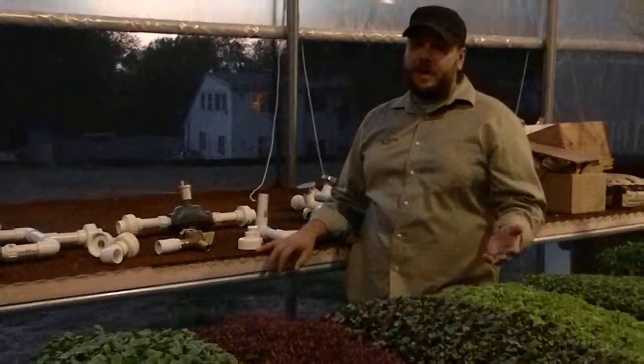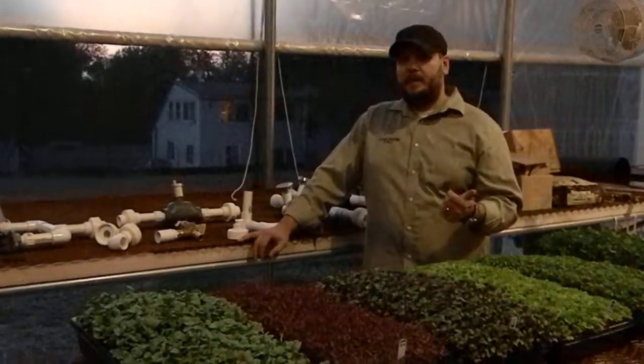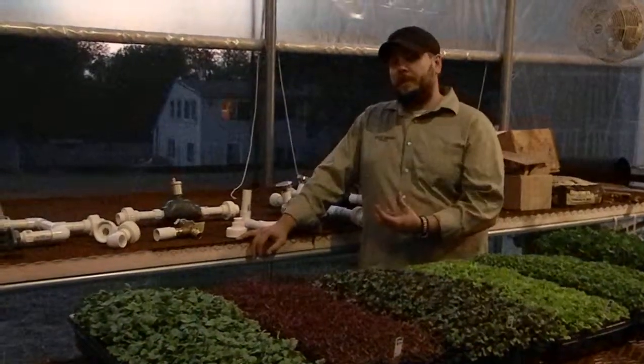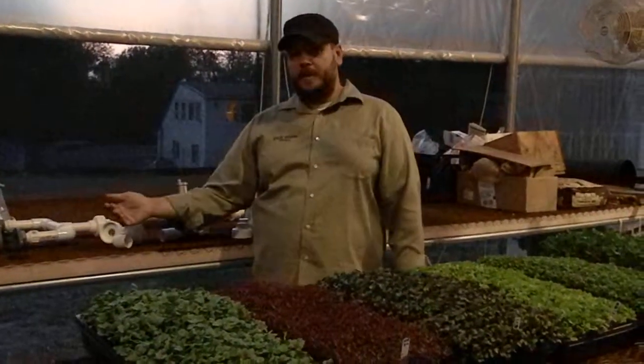It's also important, when there's a lot of money associated with some of the crops that you have inside of these greenhouses, to be thinking seriously about redundancy. In our example, our hot water heater has 2 heating elements in it and 2 thermostats. Therefore, if either one of those ever failed, the system still should be able to limp along on one. As I've shown you here, we're doing redundant pumps so that if one of the pumps fails, I can also continue to use that system.